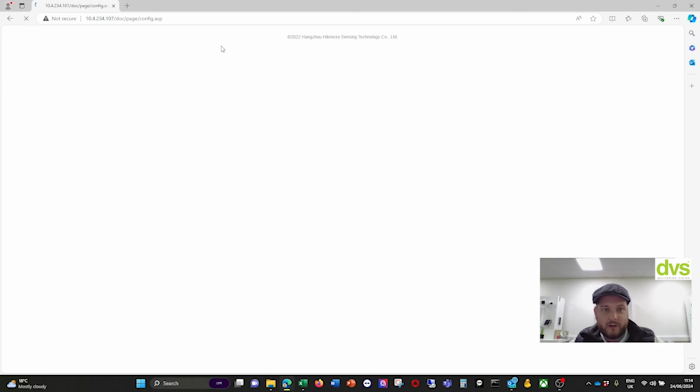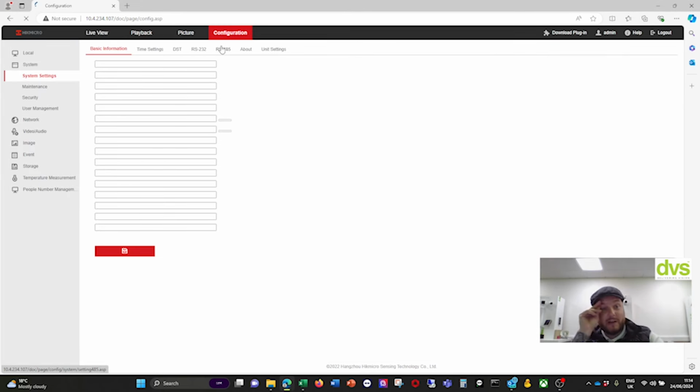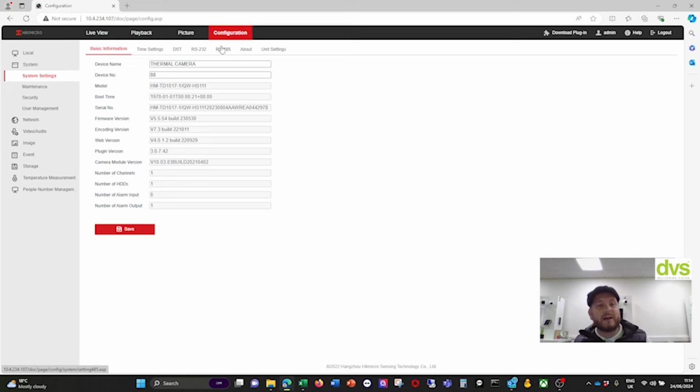So if you go into configuration, like I said, this is powered by the PoE adapter. It's on the network effectively. So I've just web browsed in. You can use it standalone. You can just Wi-Fi into it using the hotspot SADP tool, set it, web browse into it, and then set it up with the external alarm contact. Or you can use it as part of an IP system, a much deeper IP system. It's really up to you. So you've got LAN and Wi-Fi. That's what makes this so powerful.